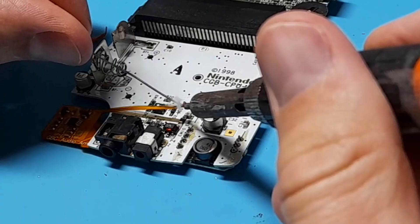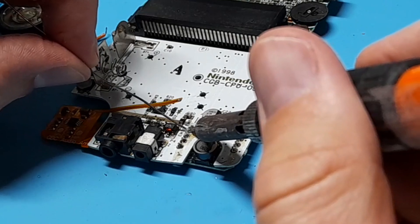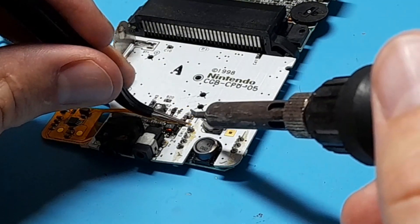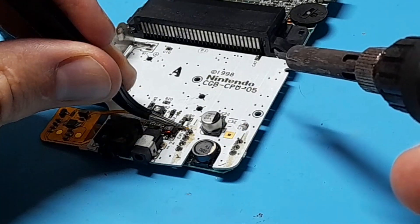With those points connected, we're going to flip the board over and solder that last point. I forgot to pre-tin this point earlier — doing it while it's off the board will be way easier. With solder added to both the board and the ribbon, do the exact same thing and just drag the solder into each other to merge them.